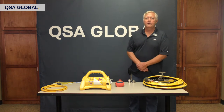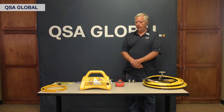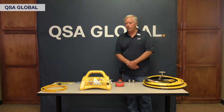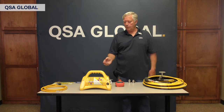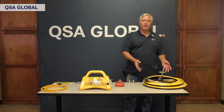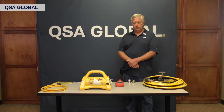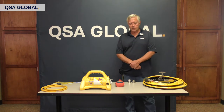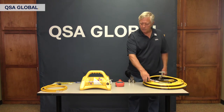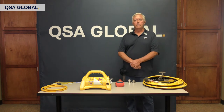Prior to this event, a poll was taken with a number of our customers to decide what would be helpful and what we should speak about. It's been decided that I'll give you a little bit today about the proper survey techniques, the visual inspection of your projectors. We're going to talk about the proper daily inspection techniques for your controls, your guide tubes, and last of all, how to properly execute a misconnect test — mating up between your controls and your projector to look for different wear components to see if it's a go/no-go situation.